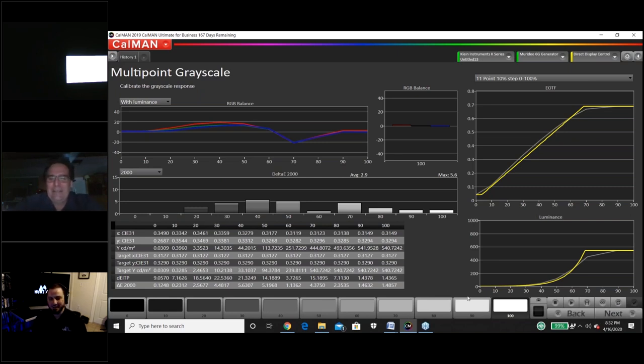Yeah, it's not that much different from a flat panel. That's where I have most of my experience. It's really important in HDR on a flat panel to get this line to line up as best as you possibly can. And sometimes that's a combination of playing with the contrast and your picture mode. So you'll find on a flat panel a combination of things that'll help you get this to track well. But regardless, you've got to do something. You can't leave it in its factory state. Yeah. And this gamma D is just too dim.